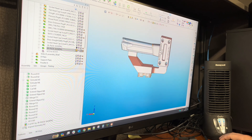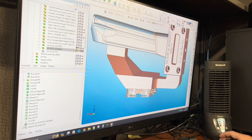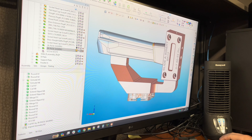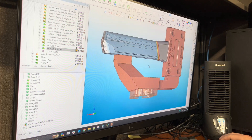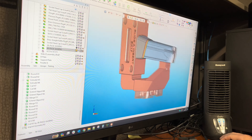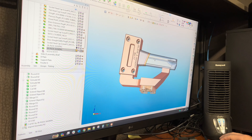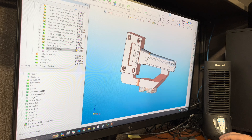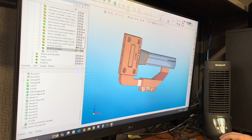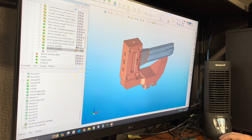This shape is actually Brandon's design — it holds this part very rigid in our 5-axis machine and allows us to remove all that stock without any vibrations when machining. This will go through a soft machining process before heat treat, and when we get it back from heat treat it's going to get hard milled. We'll actually show this process out on the floor as we go.